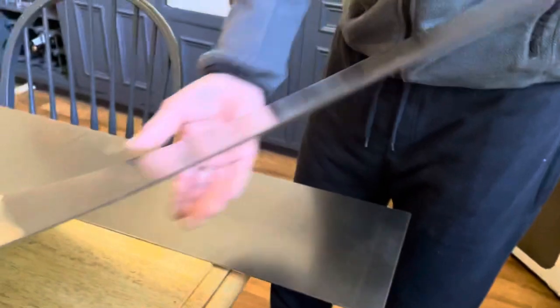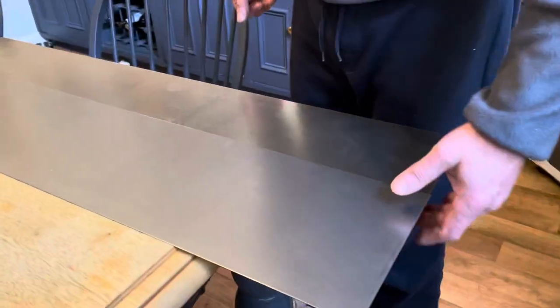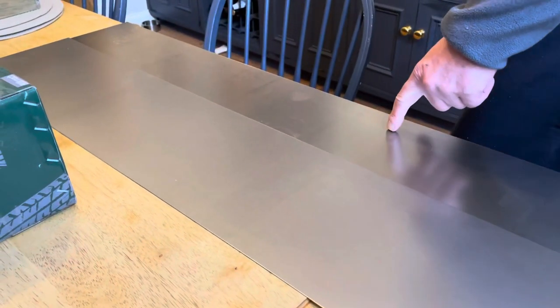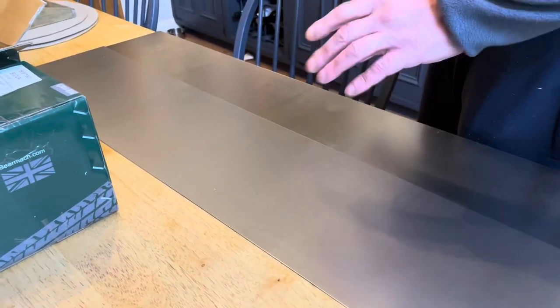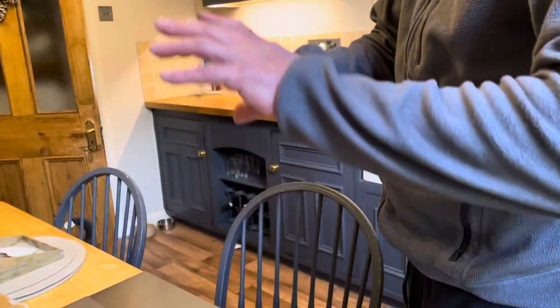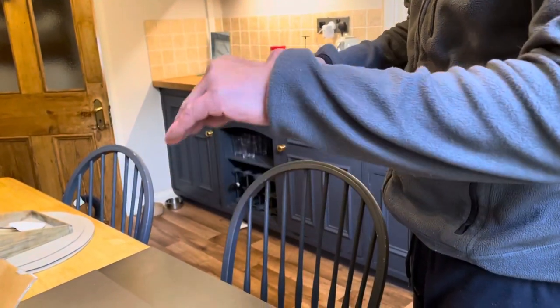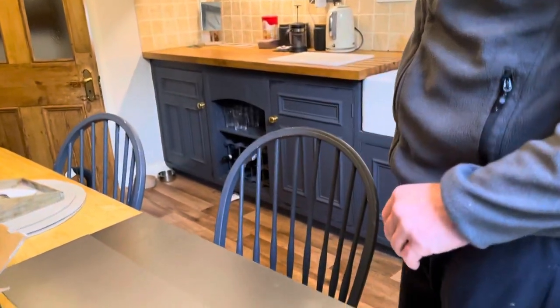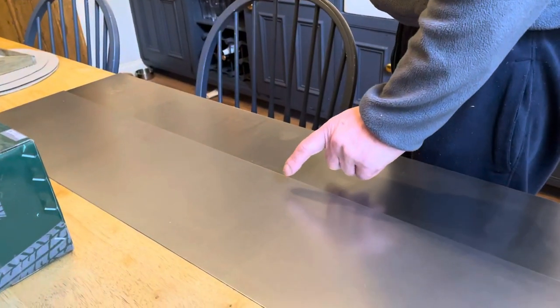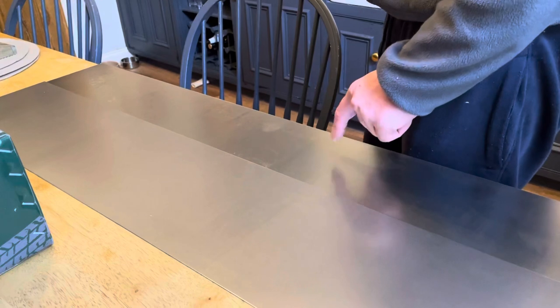This sheet underneath is 1.2mm and 1.2mm is for the bulkhead — that's as good as factory, not better but as good. So 2mm for the chassis and 1.2mm for the bulkhead. Now we've got some floor forms coming in — the floor pans sweep up and that's where you put your feet. I've got floor forms already with the right creases, nuts and bolt holes. This 1.2mm is just for repair of the flat bits of the bulkhead, no creasing.